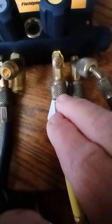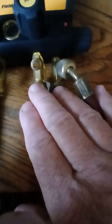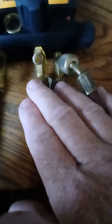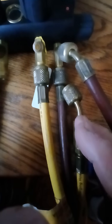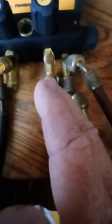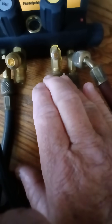You do not want to pump air back into the system. So once you've connected the hose onto the tank and you've got refrigerant, crack this valve for a second and you'll hear a noise — let the air go through. Once the air goes through, everything should be fine. Do it once or twice so you know you're pushing straight refrigerant, not refrigerant mixed with air and non-condensibles.